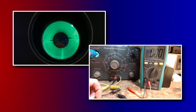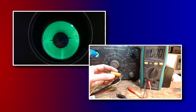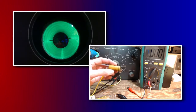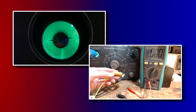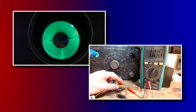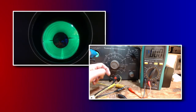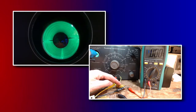I must have some capacitors mixed up, or I've mixed up my chart a little bit. No, I guess not. Maybe I wrote some readings down incorrectly before. So this is supposed to be a 0.05 C10. Before I read 0.05. What have I done here? This is what happens when I'm talking and doing these videos. I'm thinking about too many things at the same time. It doesn't take much anymore for that to happen. So here we got 0.15, I would make it. Last time I got 0.2. Now this is supposed to be a 0.05 capacitor. It's reading four times its rating.